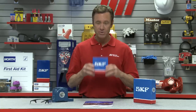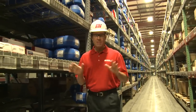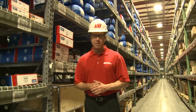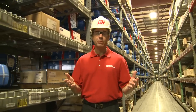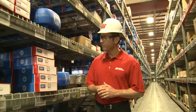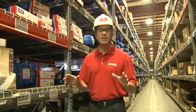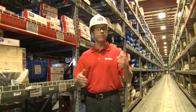We're not returning either of these because they both look really good. Now let's move on to storage. The storage area needs to be cool with a steady temperature and controlled humidity — such as 75% at 68°F, 60% at 72°F, and 50% at 77°F. The area should be vibration-free and draft-free, similar to the one shown here. You should store the bearings flat on the racks with adjustable shelves and employ first-in, first-out organizing.